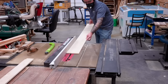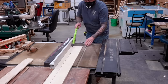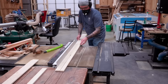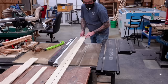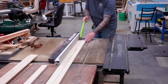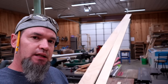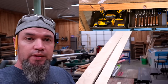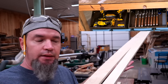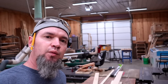I will be teaching you step by step how to build this, but if you are a plans-in-hand type of person, head over to my Etsy shop — I'll throw a link in the description. We're going to start by cutting the parts for the sides of the box. This can either be two inches, great for smaller hand tools, or three inches, which is perfect for drills and drivers. For these sides I'll be using half-inch plywood. For this video I'll be making a storage compartment with a three-inch side.